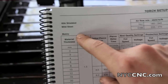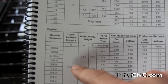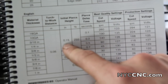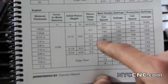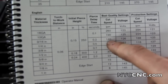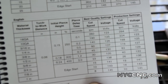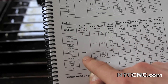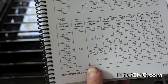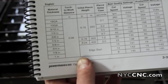In the Hypertherm manual I'm on the 65-amp mild steel shielded consumables page, cutting 3/16ths. I do have the pierce height set at 150 thou and the pierce delay set at 0.2 seconds. I'm starting at 140 inches per minute and the optimal cut speed at that setting is 140 ipm. I did set the voltage to 126. I also set the torch-to-work distance to 60 thou by adjusting the initial cut height on the AVHC — the default Torchmate recommends is 0.13, so I'm going from 0.13 down to 0.06.